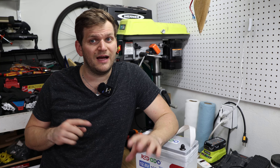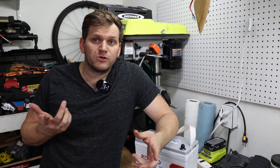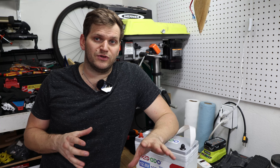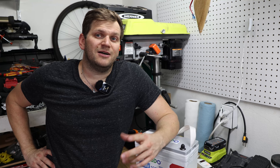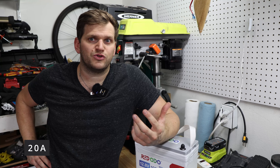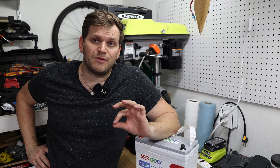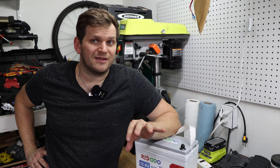Let's summarize. I've had this battery for probably two to three months, using it not only for camping and overlanding, but having it in the car, charging with solar, charging with a DC-to-DC charger from the car at 40 amps, normal charging, and capacity tests — charging from this battery to another. I did all those kinds of things, which really worked well. The capacity test for this video passed at more than 100Ah still available. The life cycle is way, way more than expected for this battery, especially when you use it with 0.2C charging and discharging — around 20 amps for this battery. I really like this form factor, which is amazing.